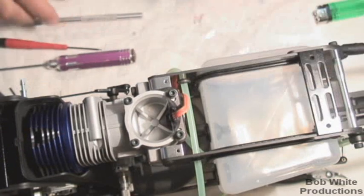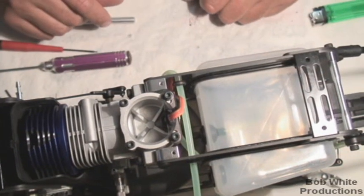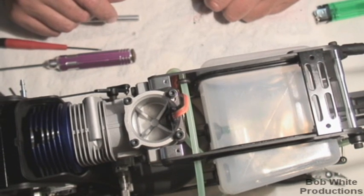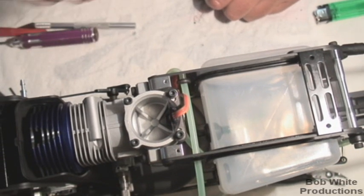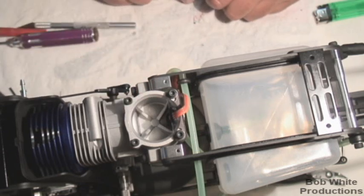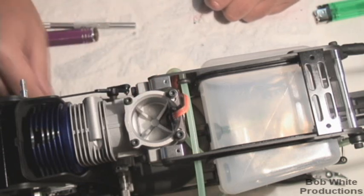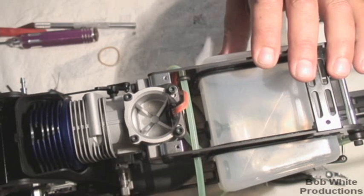So we need to test the sensor. But before we test the sensor, I need to go into calibration and calibrate the governor — teach it the low and high throttle points and the rev limiter. Then we'll come back, turn a motor over, and check that the sensor is reading the crankcase. That finishes hardware installation. We'll come back and do software setup.